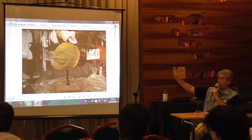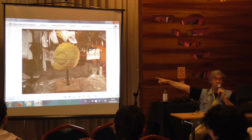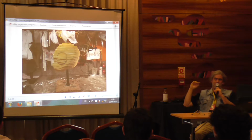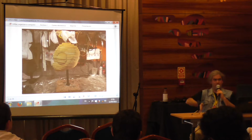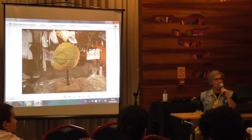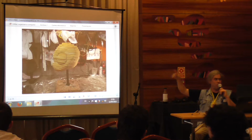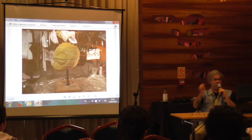That's basically what I made. That was the first time, I didn't have a laser cutter this time, so I did it basically with insulation foam of house building, cheap, 20 millimeter, a bit rough. So I made a 3D drafting and put it into pieces of 20 millimeters. And then I cut out with a band saw all the pieces and stick them together in stacks. I'm using for that standard craft glue. Or you also can use white glue or wood glue, it's also possible. No, don't use silicone, because later on you have to sand. The best is the wood glue.